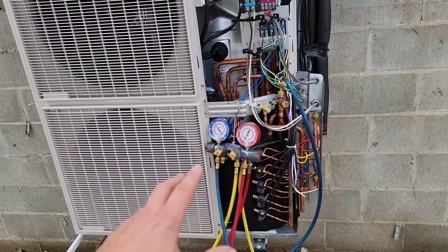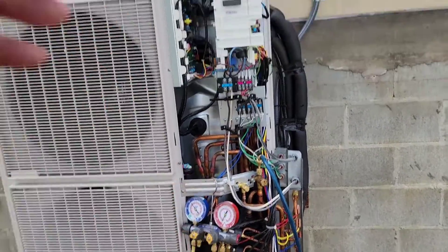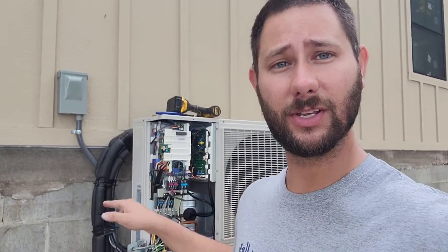This is a great method if you want to top off equipment — you've got to have gauges, the right tools, and you must measure temperature split. If you're not factory charging, turn all the inside units on. If you have a multi-zone piece of equipment and you don't, your unit will not ramp up to 100%. I'm going to show you the switches I use to do the pipe check mode operation.